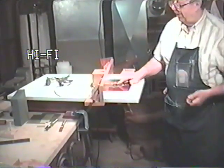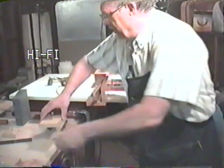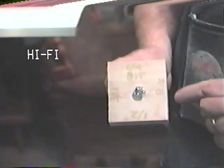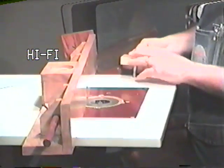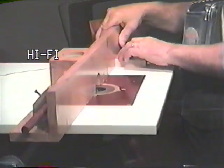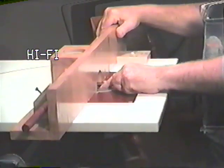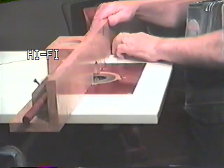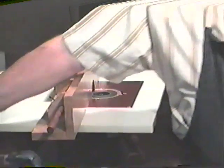On the other hand, if we wanted to relocate it relative to the front of the bit, we have a special locating post set up for different bits — here's a quarter-inch bit, five-eighths, one half, or three-eighths inch bit. In our example of a half-inch bit, I would set the half-inch face. When I bring up the fence, it's located relative to the front of this bit, so any spacer I use sets up the distance relative to the front of the bit. This scheme allows us to very accurately, very quickly, very easily, and repeatedly set up our work — either from the center of the bit, the front of the bit, or the rear of the bit.